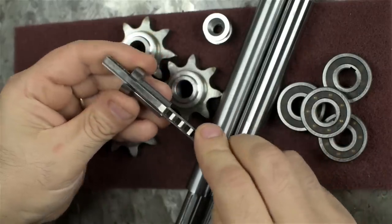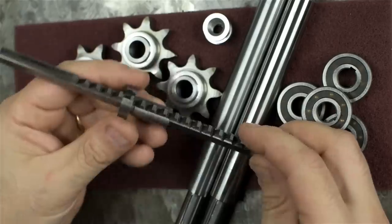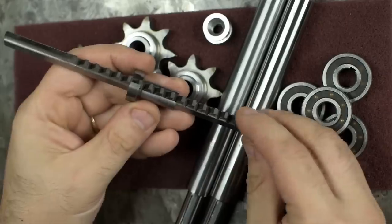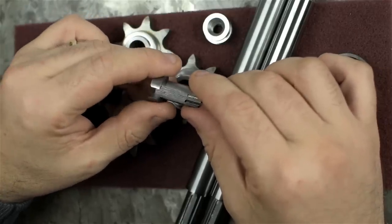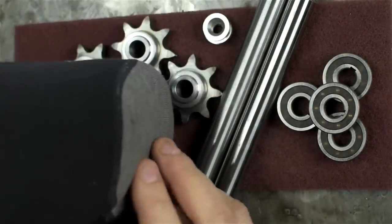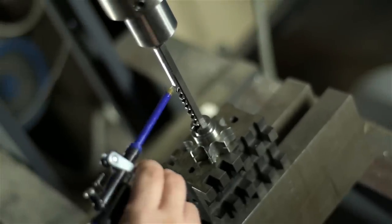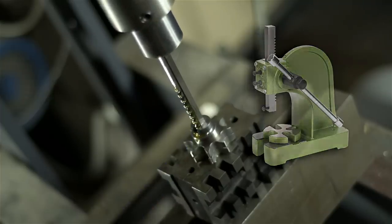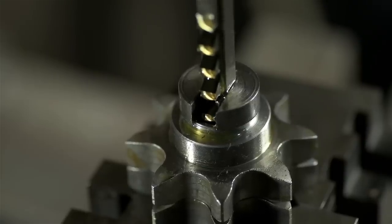I've sized the depth of the slot so that pushing the broach through without any shim results in a half millimeter — 20 thou — depth of cut. These cut in multiple passes. After each pass, you'd introduce a shim in the back that pushes the broach forward, increasing the depth of cut by whatever the shim thickness is. By the way, if there's anyone out there wondering what authority or business I have talking about these things, I'd just like to bring to your attention that the sweater I'm wearing has elbow patches — I'm pretty sure those speak for themselves. Let's head over to the press and push this broach through. This would be a much better job for an arbor press, like a small little manual arbor press. I don't own an arbor press. This is also the smallest broach I've ever pushed in this hydraulic press, and you can bet I'm wearing every pair of safety glasses I own.